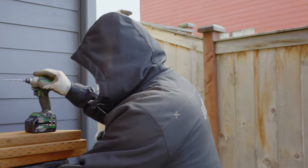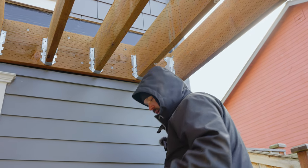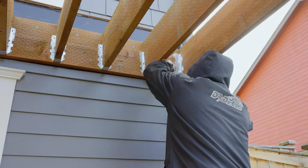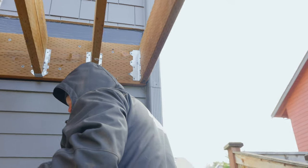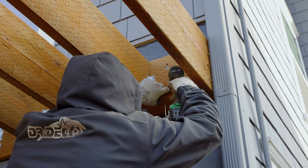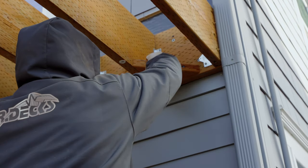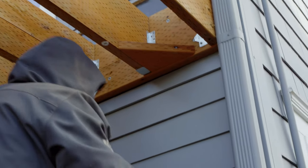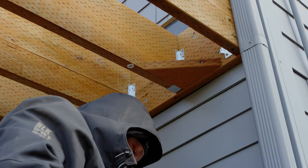Right now I have a tapered pre-drill bit on my drill and I have my first piece of wood cut at a 90, and then the rest of my pieces will be in parallelograms with 45-degree angles. I've already pre-measured everything, but we're going to go ahead and screw this in. Just like on a previous video we did, we're still using a four-inch timber lock for these attachments. I'm going to grab that bit and pre-drill so I'm not cracking out these blocks.